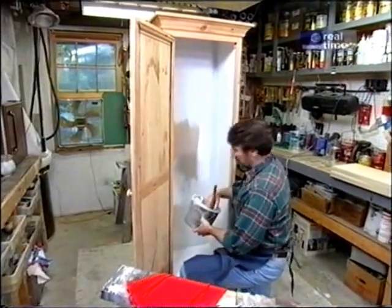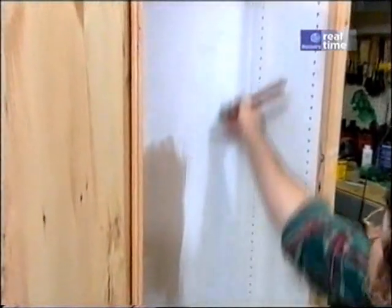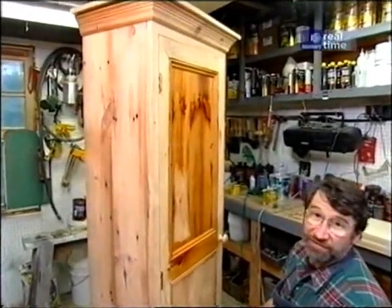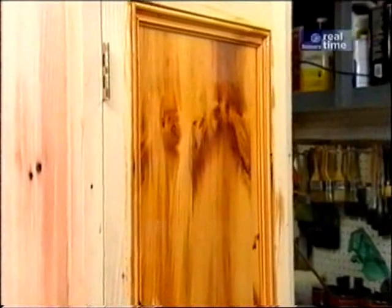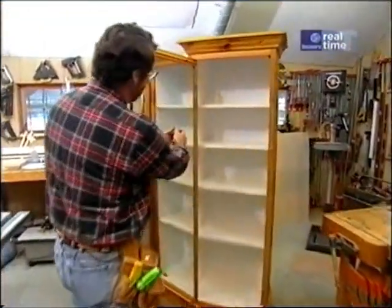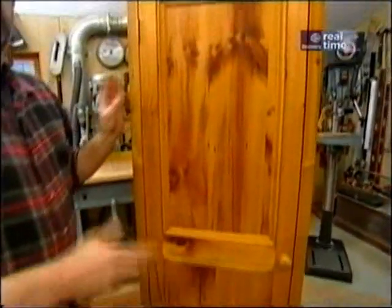The first step in the finishing is to prime the interior. I'm using a high-quality alkyd-based primer. Once this is dry, I'll give it a light sanding, and the finished coat will be a high-gloss latex enamel. Now for the pine — we're using one of our favorite finishes: a combination of stain and polyurethane, a satin finish. I put on at least three coats with a light sanding between each. When the piece is all done, there's no better look for this antique pine. There it is with the mirror installed and a coat of white latex paint on the inside. This is a very useful project. They didn't exist historically, but I think a lot of people are going to want them.